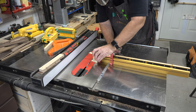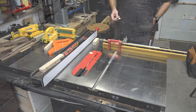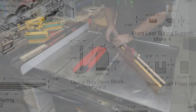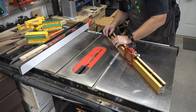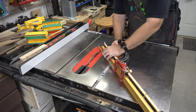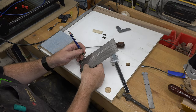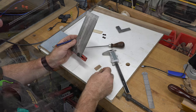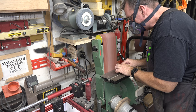Making the tail light panel is nothing special — rip your 1/16 inch stock using the same method as earlier by trimming on the outside of the block, cut it to length, rip it, do some miters, a little sanding, and you're finished. For the dump box pivot blocks — two of them — the only advice is to cut the miters first. Get a longer piece that is five-eighths of an inch wide and one-eighth of an inch thick, cut the miters on either end, then mark your radius, drill your holes, and cut on the scroll saw outside the lines and sand up to them.